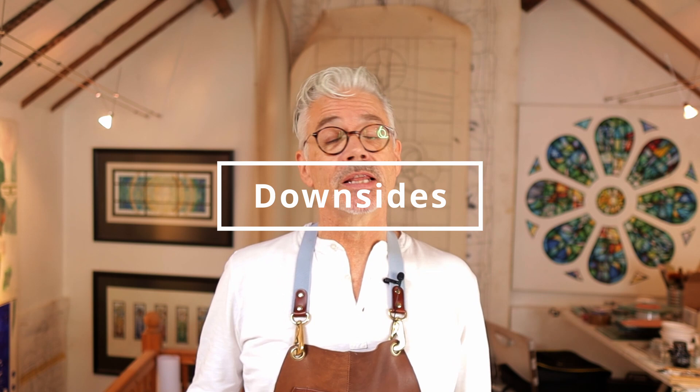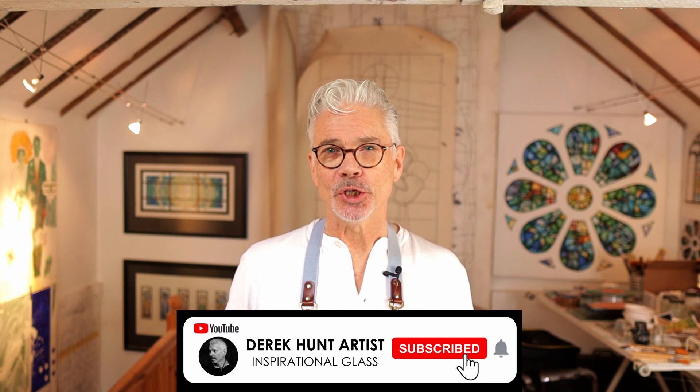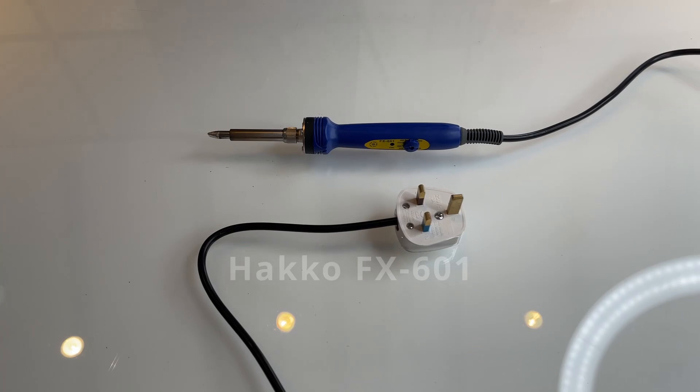There are a few downsides to using this type of iron. The main one is the lack of control in changing the temperature of the iron, especially if you want to reduce the heat to prevent accidental burning or melting of the lead or copper foil you're working on. I've also found the handle of this iron can become too hot after a while, so much so that I've had to switch it off to let it cool down before continuing. Also, having the electric cable running to the iron always presents the possibility of accidental damage to the wire due to poor cable management. I'm always a little nervous about teaching new students how to use this type of iron, as it's really easy to touch the cable with the hot tip by accident. So just make sure you know where the cable will be resting as you stretch and move around your work area.